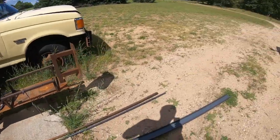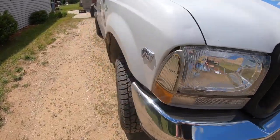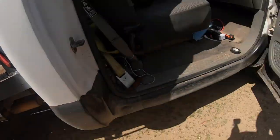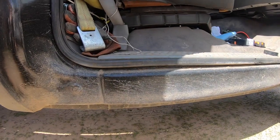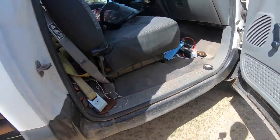You might see the old tool chest and old bottle rack that were on my truck — I've upgraded, and we'll talk about that. To go back to the sheet metal brake, it's been really handy. I got the body work done on my welding truck for cheap — the main reason was I bent my own rocker panels with the sheet metal brake I built. They turned out pretty darn good, and the brake paid for itself. I built it mostly out of scrap metal I had, along with a few bolts and welding wire.